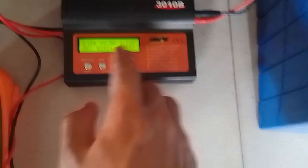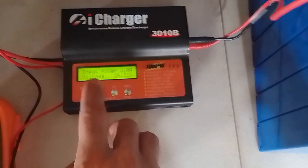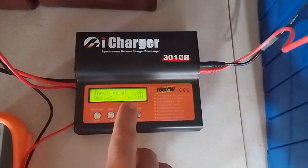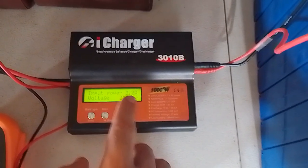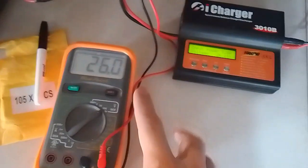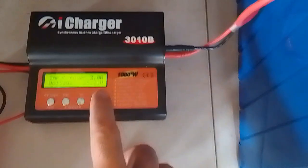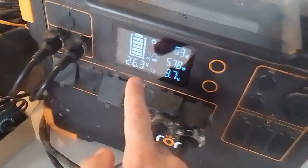It's going to take it down to 2.5 volts, which is all right. Input power — this is what this sees on the lead acid. So it sees them at 26.21 volts, and we're putting 3 amps into these batteries right now. My meter is hooked up, so it sees 26.1 volts versus this thing thinks it's 26.2 volts versus the Pekron itself thinks it's 26.3 volts.